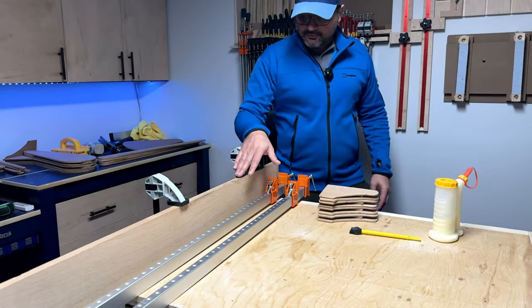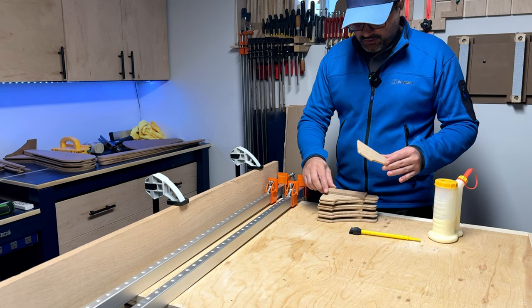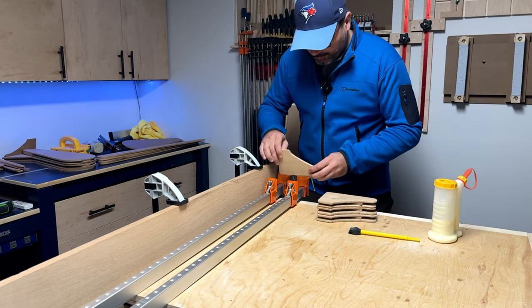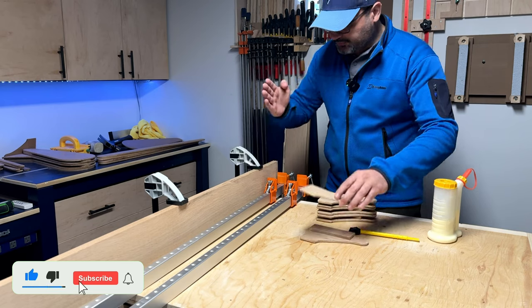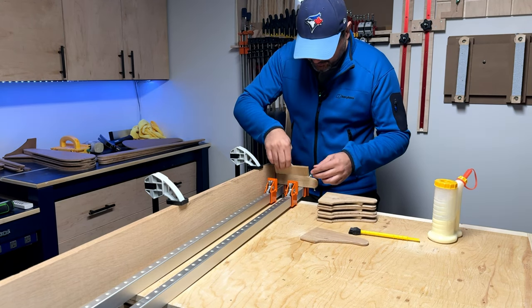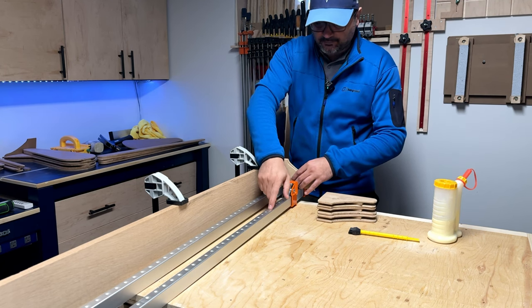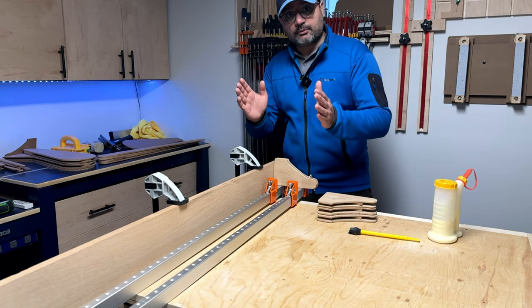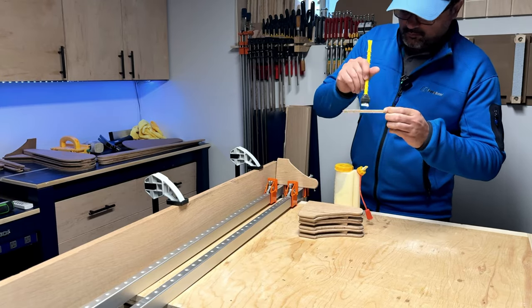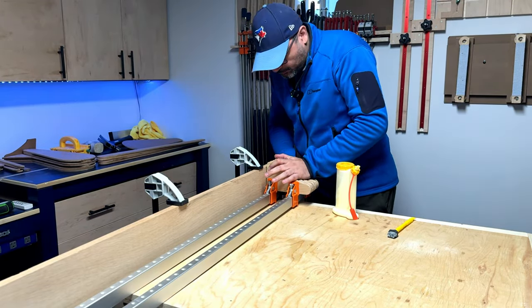I have this contraption — quote unquote a jig. I'll put this piece of wood between the two shoes, but I want the wood to drop all the way to the bottom and all the way to the back. I have a jointed piece of oak which I know is straight, so when I push in I can make sure it's touching the oak, then take the piece, put it inside, take the next shoe, put it after that — and I know it's sitting level against the clamp and pushed against the oak, so it's positioned correctly. Basically I'm doing the same thing I did with the torso: creating width so I can drill and have stability.